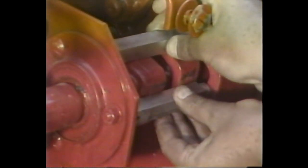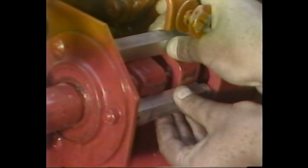When the head has been leveled and locked, we can then align the drive shaft if necessary. To check the alignment, you'll need two small pieces of metal like those we're using here. The metal pieces must have at least one straight edge. Place the metal pieces on the coupling halves in the position shown and sight the horizontal and vertical alignment.